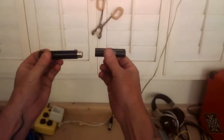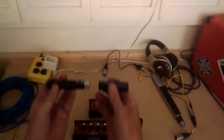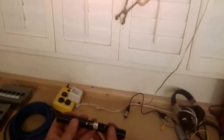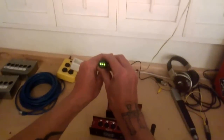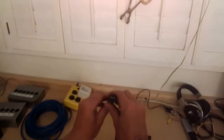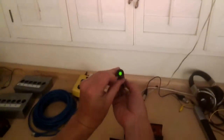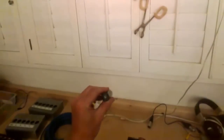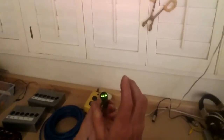The two products are the SoundTools XLR Sniffer Sender units, which we've been making for quite a while. It's a remote end tester — it allows you to test mic cables with the ends located at a distance. You don't have to have both ends or run an extension cable out to test it. There are three LEDs, and if the three LEDs light, it's good — three greens means it works, and it'll test every possible fault. There's an on/off switch in the back of the sender unit, and when the unit's off it draws no power. If it's on, it draws no power unless it's plugged in and the other side is lit.